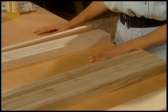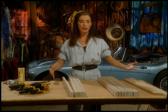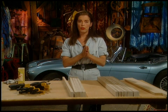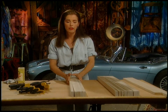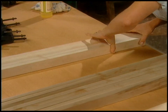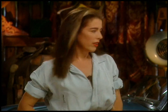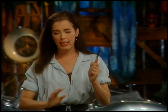Why a clump of five? Why not just glue all the boards at once? Because it takes too long and the glue starts to dry and then the boards don't stick together. The glue holds the boards apart because it's already gone a bit crusty and skinned over. Therefore I'm only going to work with five boards at once. And I'm going to do five clumps of five. So I'm ready to go now with these five. I get my glue and a putty knife.